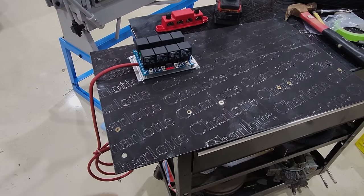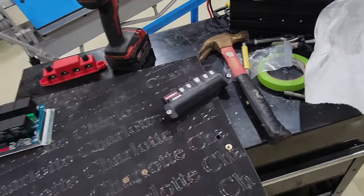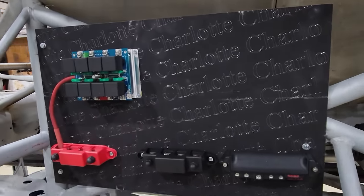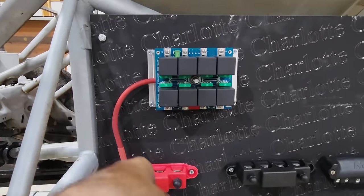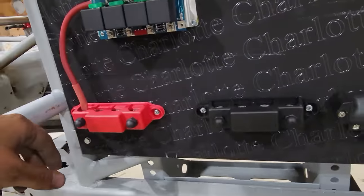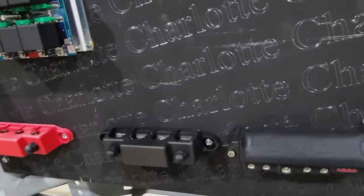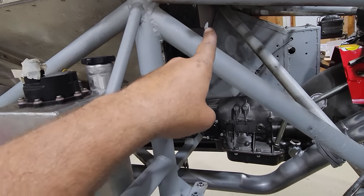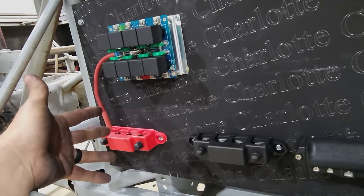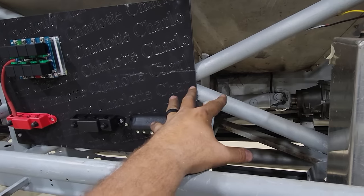The guy made a switch to M5 nutserts — and definitely not because I snapped off the tool — so we've got all those in. The board is back up and the first official wire is terminated on Charlotte. It's still loose in there but it's going to look pretty nice, and man is it going to be nice wiring this thing — I ain't got to lean over any hood, I can do it right here. Next we're going to go ahead and throw the batteries in, get those terminated, and start running the wires up to our battery switch.